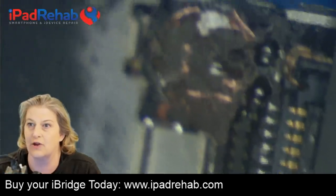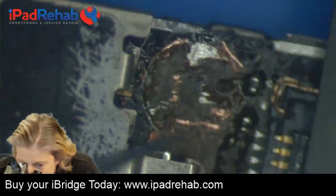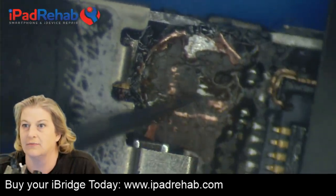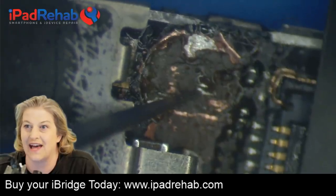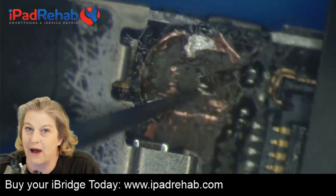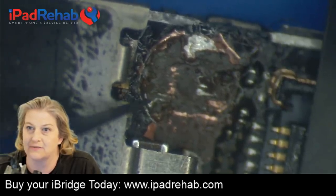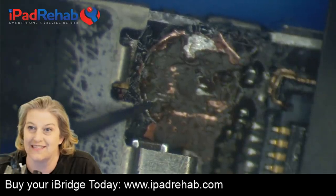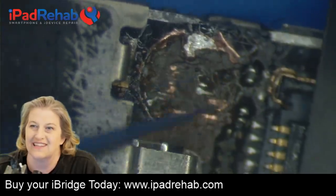For no image on an iPhone 6, long screw damage actually severs the trace that I call the lollipop. This one right here gets cut. This one is that LCD power enable line. And then the other one has this little sideways microvia over here. This guy is reset. This is the other one that gets broken. So those are the two that get broken.